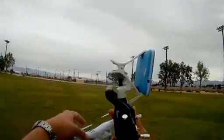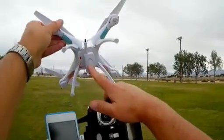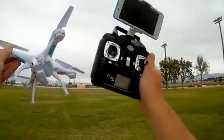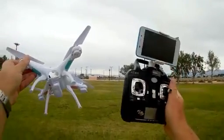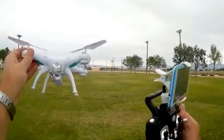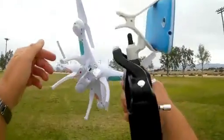What I've done recently, I've done a video that showed you can increase the range of this if you just turn off the camera, because the camera is operating on the same 2.4 gigahertz as the transmitter here. And because of that, it's creating interference with this transmitter. But another thing I'm going to look at today is to operate with the camera on and actually do a watch.